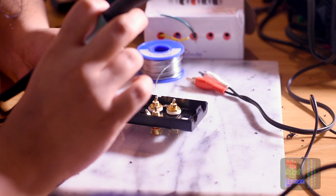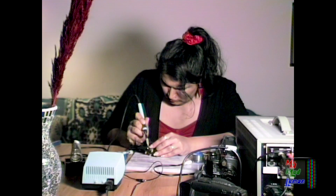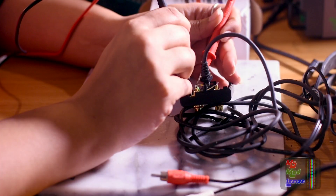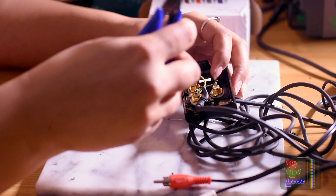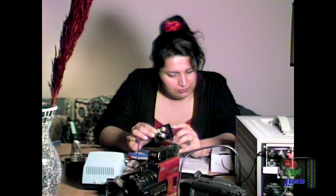I know what video is — it's sort of gray, light gray. Then the thick ground. Okay so that's soldered. Let's test now. Okay, that works. So the yellow wire — I've got no idea what it is. There seems to be eight volts coming through it, so I'm just going to clip that. Either way we've got AV coming out of it. It's probably not stereo — it's probably mono. So what I'm going to do is double that up so it can be dual mono.